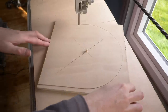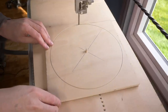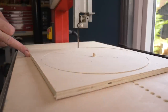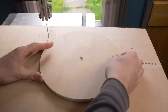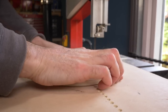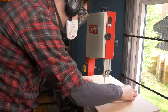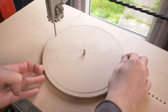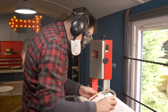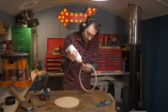Once I'm at the stop I can slowly start turning the disc. The first one has come out really nicely so I get the second one on and do exactly the same. When the second one is cut out I get the pin removed, move it over one closer to the blade and get it back on. I can then push it back into the blade and make another cut, this time cutting a ring. And this has actually worked out better than I ever imagined. Now there is that thin cut mark in the ring so I'm just going to get the two bits glued together and clamped up.